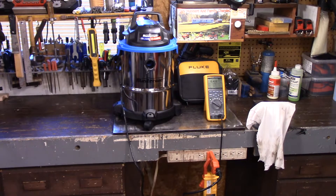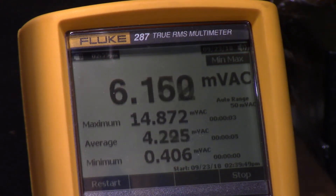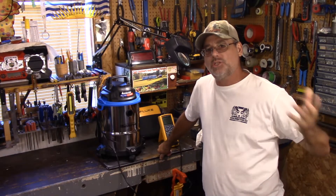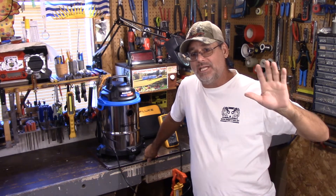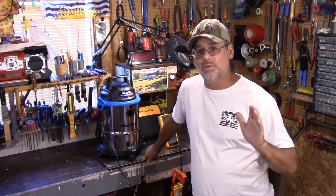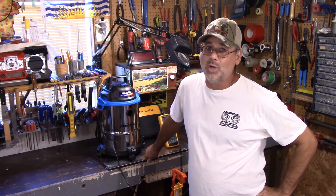Here's the setup right here, just like I always have before, and I'll zoom in on the Fluke 287 and we'll see what kind of numbers we get. So 6.1 was the running amperage — it wasn't five and a half amps. It was close, but it was 6.1, and that's roughly 730 watts. But the peak is the main thing you have to realize with running an inverter — the peak amperage was almost 15 amps.